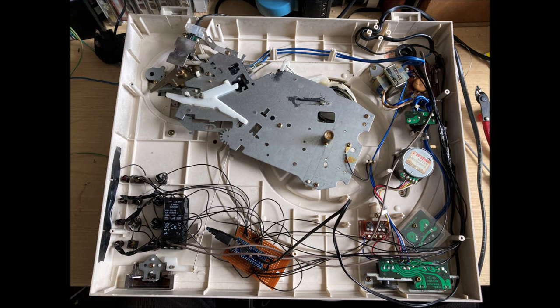So basically the turntable has 2 power supplies, one for the Arduino circuit, one to power the rest of the turntable. The finer part really was then just to secure this in place, put any insulating tape down around any exposed contacts, and just try and run the wire as much out of the way of any other connections as possible and out through where the other cables for the turntable went.